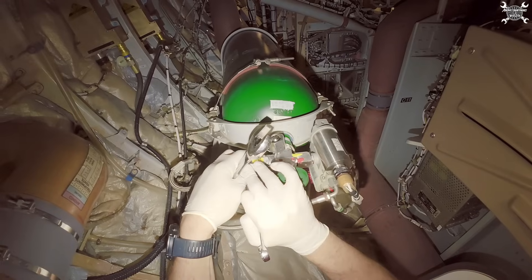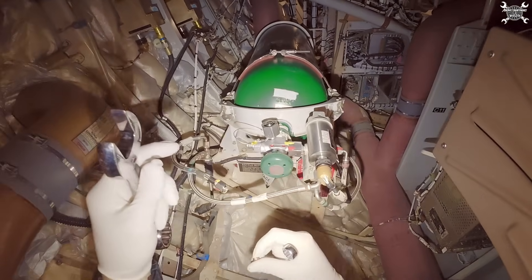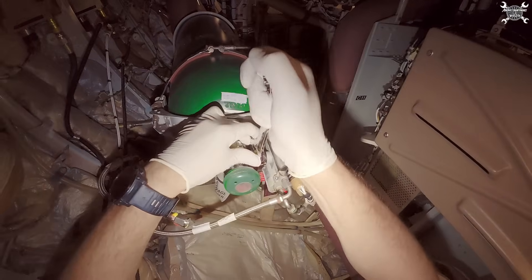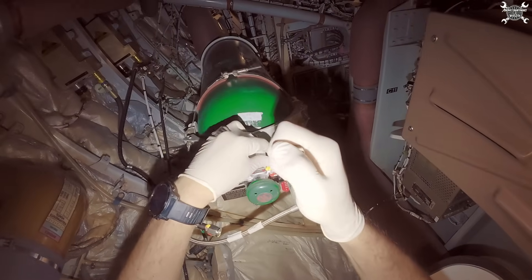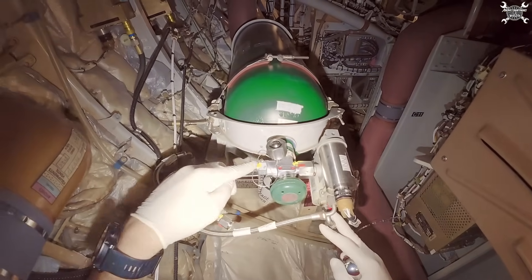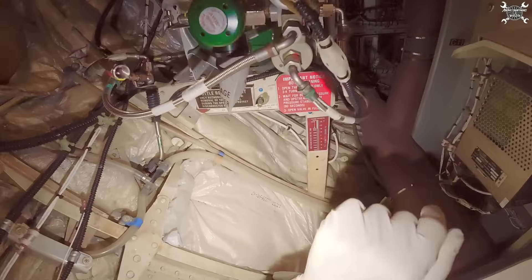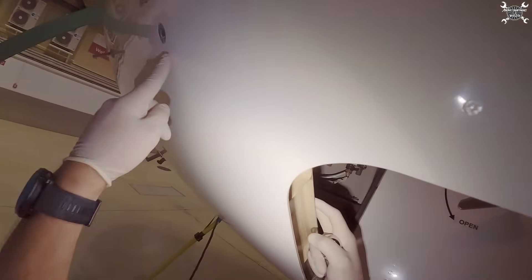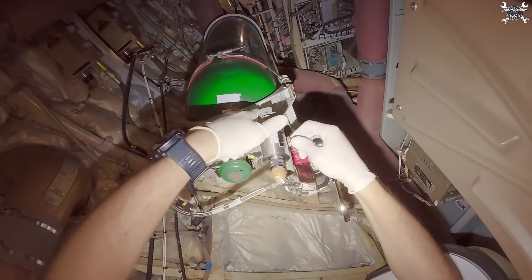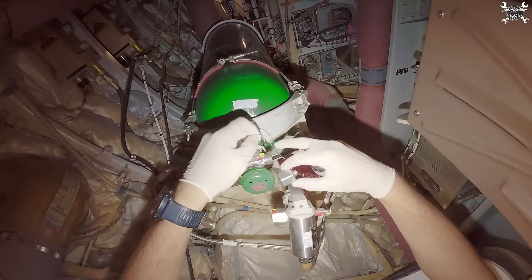First, the overpressure line. This is the copper ring which we're going to replace. This leads to the overpressure line, which is here to lead the oxygen in case of an overpressure event — either from the reductor or from the oxygen bottle — it will lead the pressure overboard and discharge. Now this section actually leads from the bottle to the reductor.